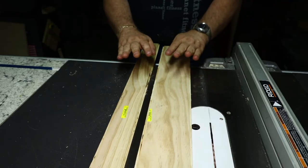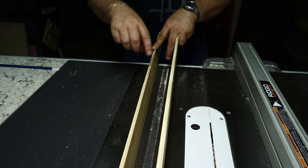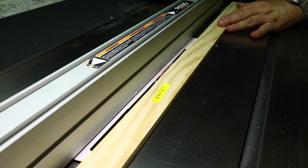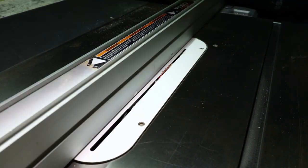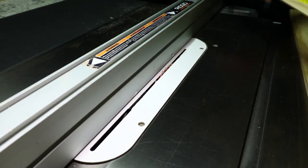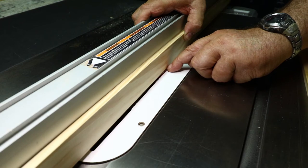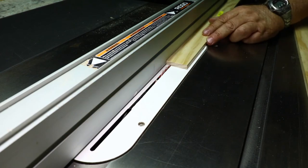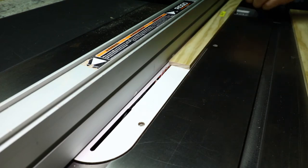These are the two vertical parts that will hold the parallel racks the bottle stoppers sit into. My next step is cutting the dados in the other boards that attach to those vertical boards — one board where I'll drill the holes for holding the bottle stoppers, and the other for the base the vertical boards attach into. I set the maximum dado depth at three-eighths of an inch, matching the board thickness, then sneak up on the width by adjusting the fence a little at a time until the tongues fit into the dados.